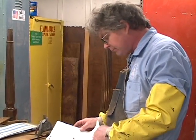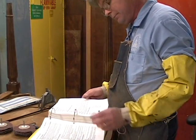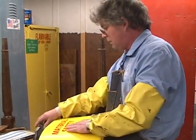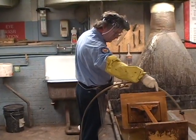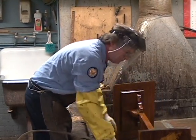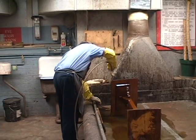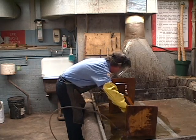As part of the job hazard analysis, this paint and refinishing employee is checking his material safety data sheet to determine the caustic nature of the stripping chemical that he will be using. Per the job hazard analysis, he will then wear the appropriate gloves to ensure that he does not receive a chemical burn to his hands. As an additional protection to prevent the burn farther up on the arm, the technician also employs the use of a protective sleeve. A job hazard analysis, such as this, has been created for every job task in each shop and should be referenced when performing such tasks.